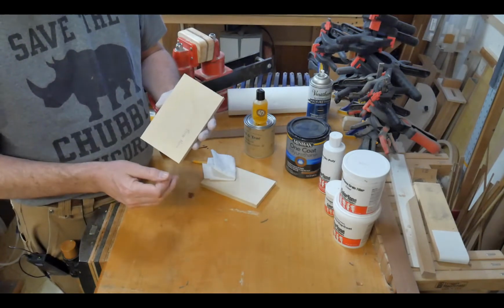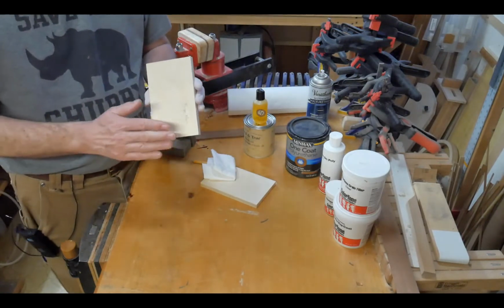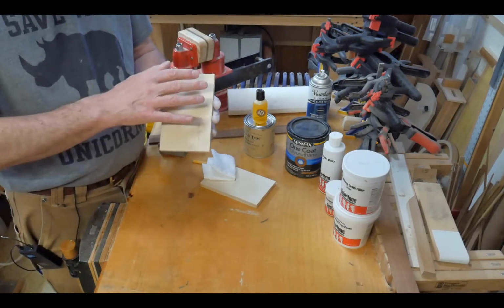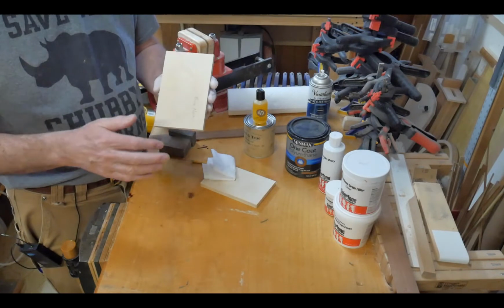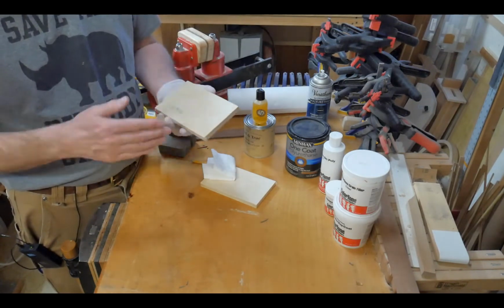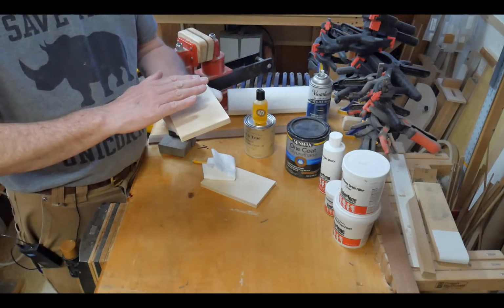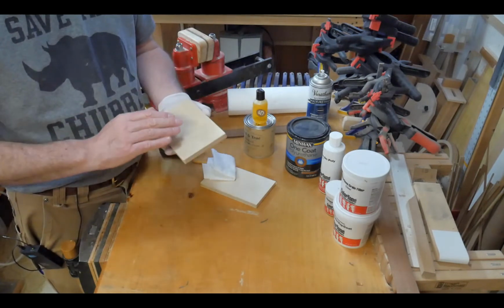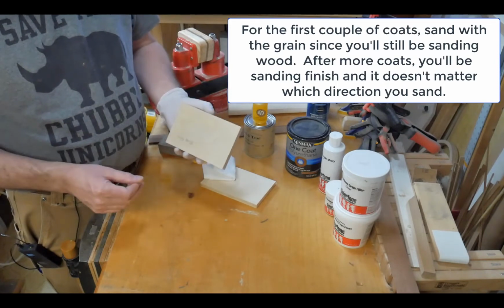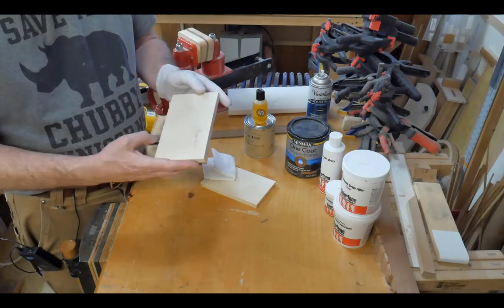After the first couple of coats go on and they've hardened and you can sand, then it makes sense to go to finer grits, because you're going to want to level the finish between every couple of coats, because when the finish starts to build, it's going to be a little rough. It might look like what's called orange peel. So before you go too far, every couple of coats, sand it flat, meaning that it's cloudy everywhere and level, so the next coat will go on flat. There's no way to put a good finish over a bad preparation. You can't do it.